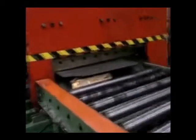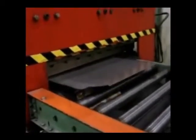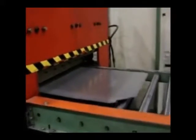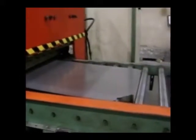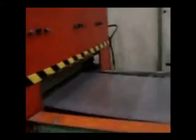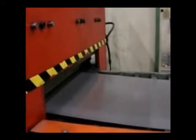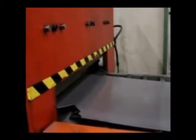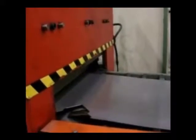Selecting from one of the three coil strip widths, the corner notch dies and roll form tooling would be positioned using lead screw adjustments with micrometer readouts. Machine setup and changeover is approximately 10 minutes for changing coil widths or the depth of the cabinet. Height and width variables are completely programmable, allowing complete flexibility to produce a variety of combination heights and widths without any setup, changeover, or scrap loss.